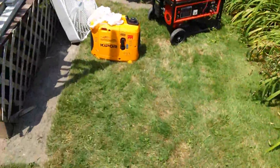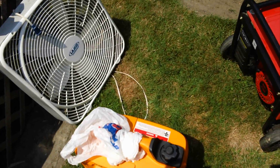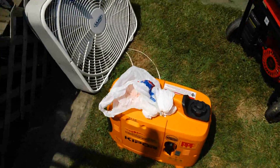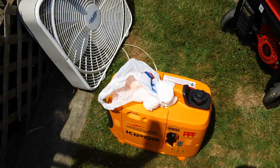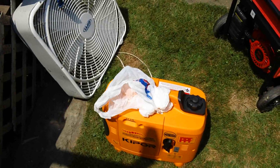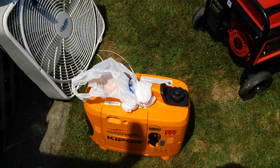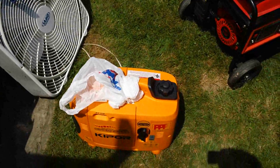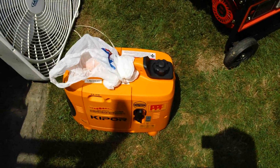So let's go ahead and shut it off. I'll have more video on this later - this was just a quick preview. Right now it has 11 hours on it. I'm going to do the initial oil change which should have been done at 10 hours, just to get any metal particles out from the manufacturing process. Then I'll be able to run a significant load on it - I was only running 100 watts before because it was a break-in load. So as always guys, thanks for watching, I'll see you guys later, peace.